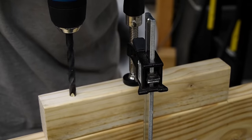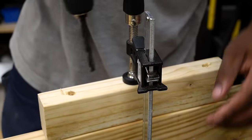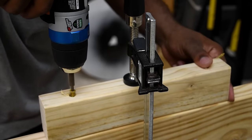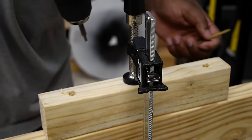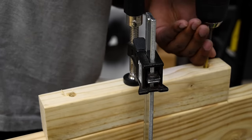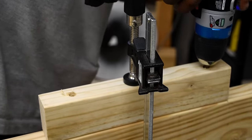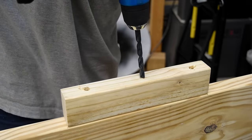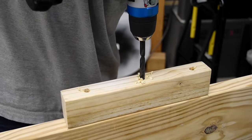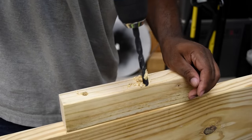and place it between each, using that as your spacer. Now, as I stated, the two outer boards will never be glued, and that's because they need to be removable. I'm now going to attach a small piece of lumber on the outside of each lumber that sits on the outer side of the bench. This piece of lumber will continue the lumber of the seat all the way to the end, and it will also cover the screws below.